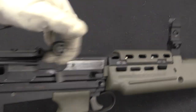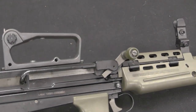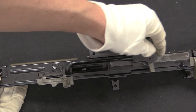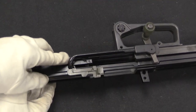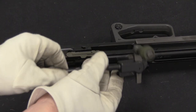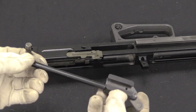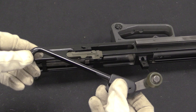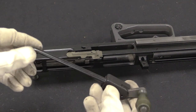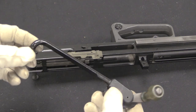The handle runs on a rail right here. Let me go ahead and take this apart, and we can pull those bits off and show you. Pulling this back, at this position you would normally pull the bolt handle out. Instead, we're going to pull out this, and then this contraption comes off. This is very loosely pinned, which is good — that allows it some flexibility to remove it, and also just for the bolt to cycle with. This is actually kind of like an AK gas piston, where it's pinned in place and not removable, but you want it to have some flexibility of motion.